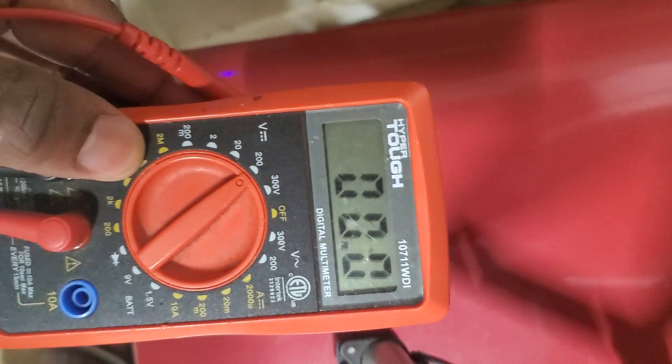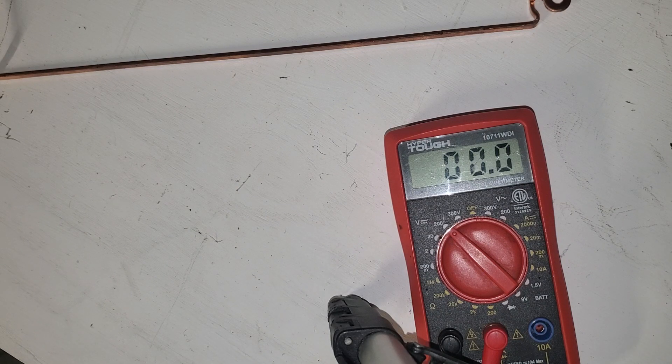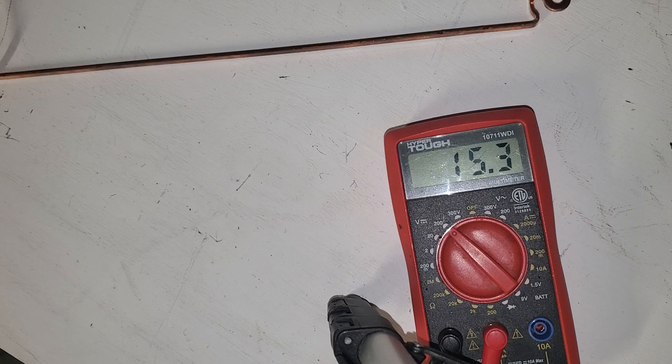Okay folks, let's test and check all the wires the way I showed you. I'm going to check it. This is the first wire — the first positive: 3.8. 2.8 is no good; this thing should not be passing 2.6 to 2.65. I'm at 2.8 — this is why I need to put a brand new BMS. Check the BMS. This is the next wire: 3.8, plus 3.7 — it goes higher. In other words my connection looks good. I'm checking every single one of them.